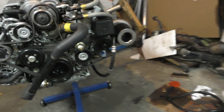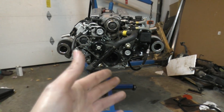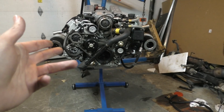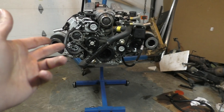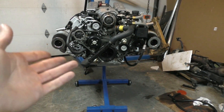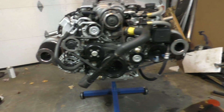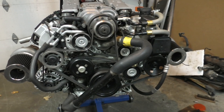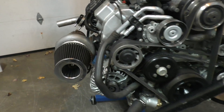For the oil drain I'm thinking I'll still need a scavenging pump, because of how wide these turbos sit on the engine. When the car goes through corners, oil isn't going to be draining down from the turbos to the oil pan — it's going to be going up to the turbos whenever the car corners above 1g or so. I'll use the same scavenging pump I had in the E55, since that worked with that car.